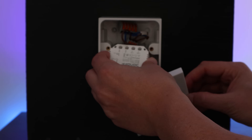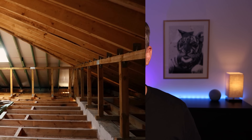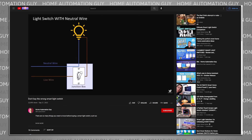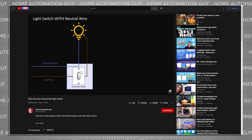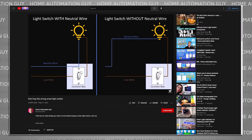There are some downsides though. It may not be easy to install these relays into the back of your switches if there's not a lot of room inside your junction box. You don't actually have to install them behind your switch though — they can go elsewhere in your circuit, and it may be easier to install them in a wall or ceiling cavity if you can get to it, but that may not be an option if you're living in an apartment. Also, a lot of these relays need a neutral wire to work properly, which a lot of people don't have available at their light switches, especially here in the UK. I've explained that in a previous video — stick around until the end and you'll see a link to my smart switch video which explains it all in more detail.